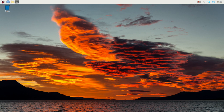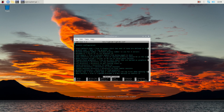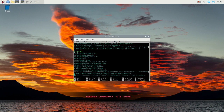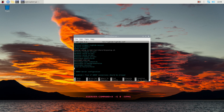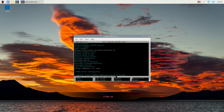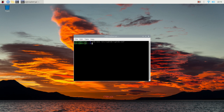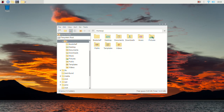First, we want to prevent the screen from going blank. It is a power saving setting on every Raspberry Pi. To turn off the screen blanking, open up the lightdm config file in the nano text editor. Add this Xserver command line below the seat configuration. Save and exit by pressing Ctrl+O and Ctrl+X. Now reboot the Pi. The screen should no longer switch off after 10 minutes of inactivity.